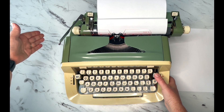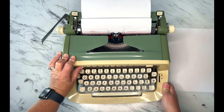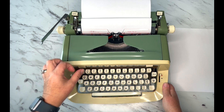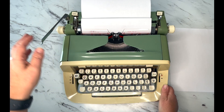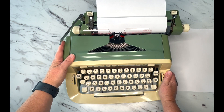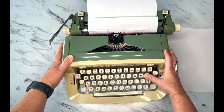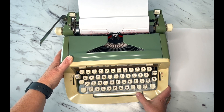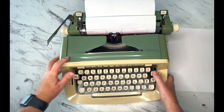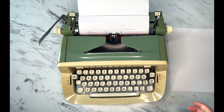Same thing with columns. Here's the column button. Let me press it — there's one set right there. I'm going to hit column clear. Honestly, on vintage typewriters the things that stop working most often are the tabs or columns. That worked — it cleared it. To set a column, just go to where you want it and press column set — that's it. Hit column to jump to it, then clear to remove it.